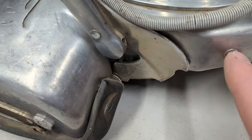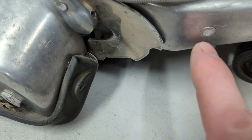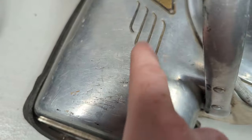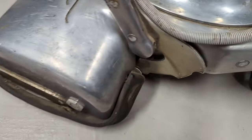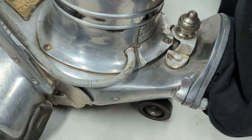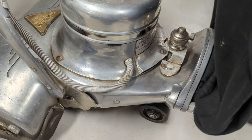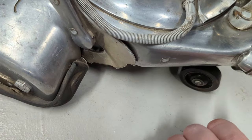You can see the little rivet here — this is what holds the fan chamber liner on the original 900 base housing. It's steel with rubber underneath, and that was to resist the sandblast action from eating through the casting.